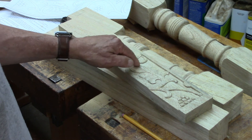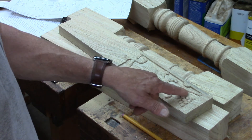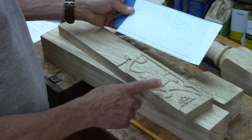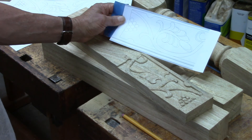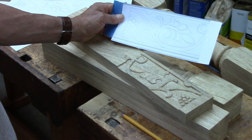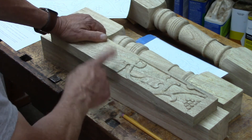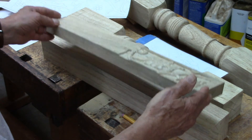The background grounding is one eighth inch deep. I did use a trim router to take out a lot of that waste, but obviously there's a lot of carving with various gouges and chisels to do this. I found the carving of this ash to be quite easy — the grain structure didn't cause a problem, the hardness didn't seem to be an issue, and it worked quite well. This will be the longest activity — getting the carving done — because I've got to do this on two different aprons, full length.